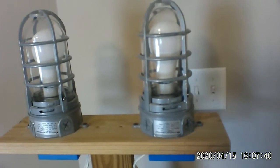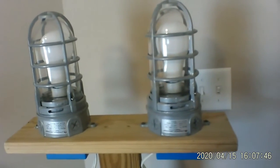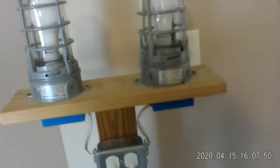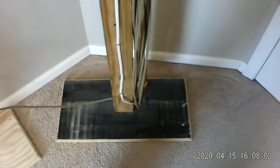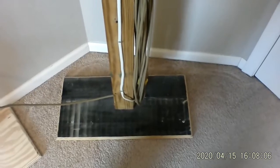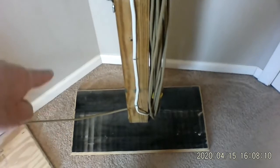I didn't want to mail order something when I could have bought it over at Lowe's or Home Depot or someplace like that, but now they're going for almost $80 a piece. This is just your standard 2x4, and it's cut at 4 feet tall. Then down at the bottom, at one time I was using planking, but that used to cup, so I took that off and now I've installed a 3/4-inch plywood. It's 12 inches this way, 24 inches this way.